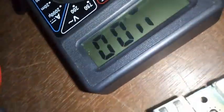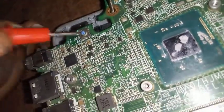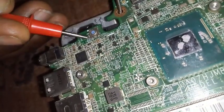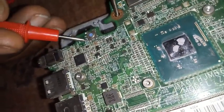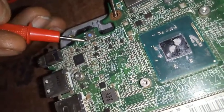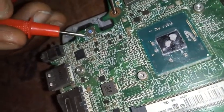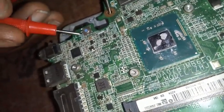3.27. It's not all the 4 legs of the switch that will read. Can you see these 2 are not reading, and this one? But this is a sign that the voltage has successfully reached the switch. So in any motherboard that you discover that the switch does not give any voltage, you will easily know that there's a problem. So I believe we are going to stop here and we'll continue in the next video. Thank you.